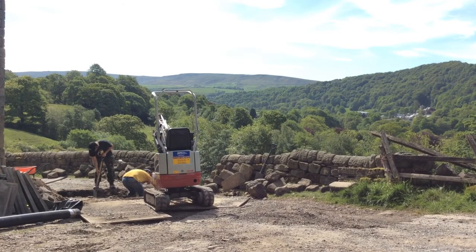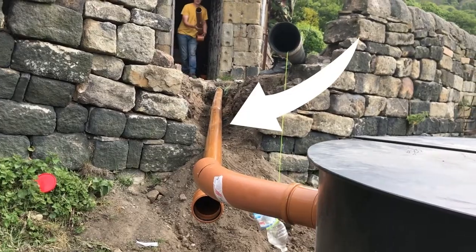But then we had to finish the trench, which we started digging, and put road plates across the road. We had to get it all exactly the right level to match up with the water treatment tank so the pipe's in the right place, and put all the backfill in. We weren't able to get the pipe in a straight line, and I didn't have any bends because I hadn't ordered them. So we had to come back on a Saturday morning early, finish the trench, and make sure it's all perfect.